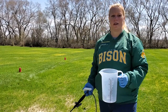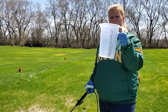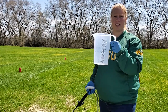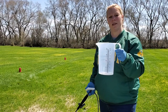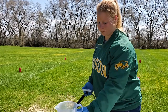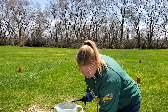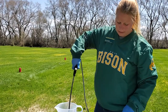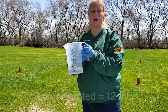I'm going to set the timer for 24 seconds — that's our average — and spray into a measuring device for 24 seconds to see what our gallons per acre output is. Make sure your measuring cup measures in ounces, because the ounces collected will directly convert to your gallons per acre. We'll put a little more pressure in the sprayer and spray for 24 seconds to see how much water we collect.